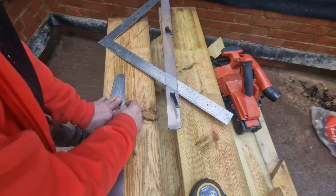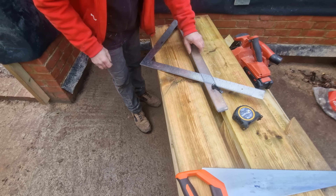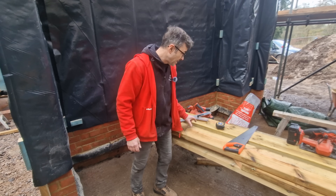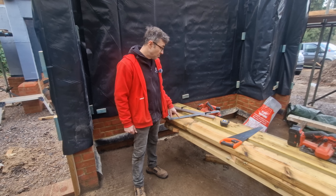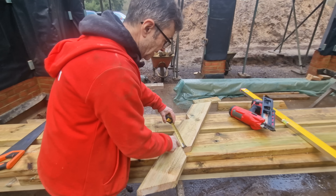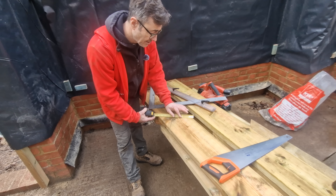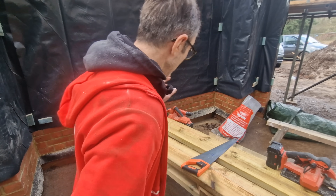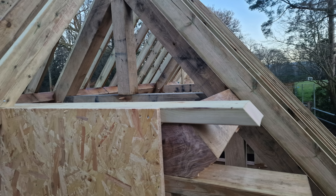There we go — that is the bird's mouth. That will make sure that all the tops of the rafters and the hip are all running true to one another. If you measured it the same as the standard rafter, it's actually going to be incorrect — it's going to pivot wrongly so none of the tops of the rafters will match up. So it's really important that you get that right. It's 153 measured up there, or six inches dead. That works out even easier — that's what I like about using imperial. So that is effectively one of my rafter feet.